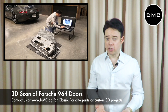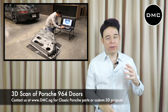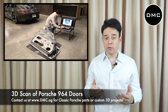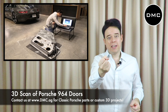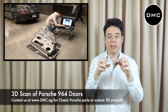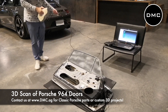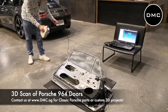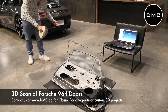That's why the more modern approach is to use a mobile scanner, like the one I'm using here in this video. Think of it as a very modern mixture of a 3D scanner and an iPhone — times ten. It has many sensors inside, including a gyroscope, so whenever I move the scanner left or right, up or down, it knows that I'm moving in that direction and adjusts the computational data accordingly. On top of that, it still does the light projection we mentioned. So we have an awesome combination of projecting a texture onto the surface while being able to move freely around the object — and that's exactly what we're doing here with the Porsche 964 doors.